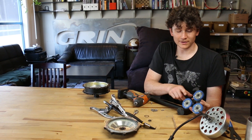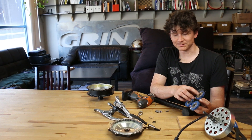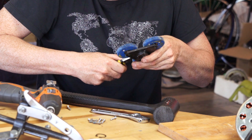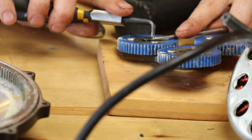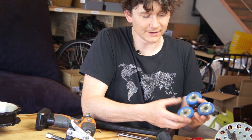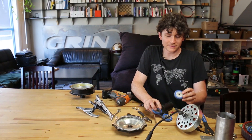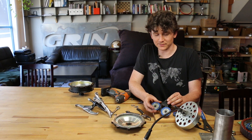If you're replacing the gears and don't have the whole assembly, each of the planet gears can be removed individually with a pair of snap ring pliers, which will free the ball bearing to slide off the planet holder. The snap ring comes off and then you can slide off the gear itself. You can do that to remove all three planet gears if needed.